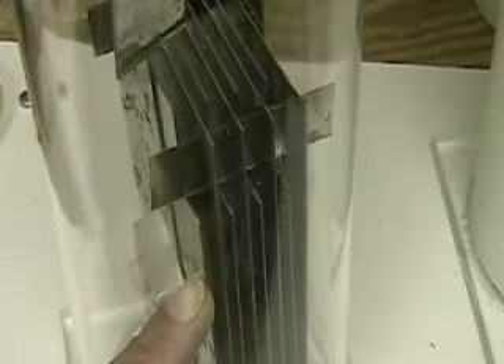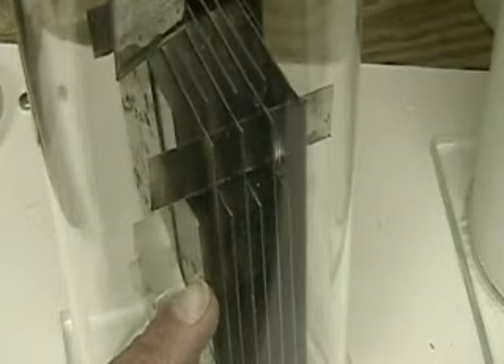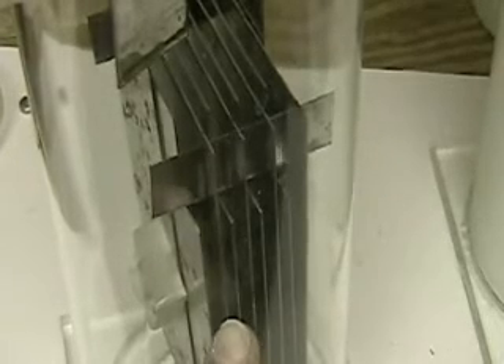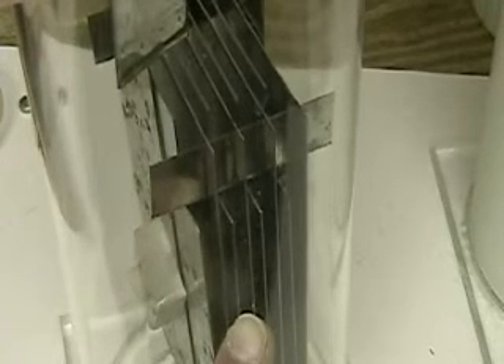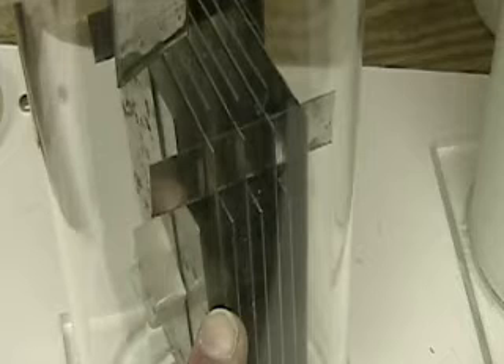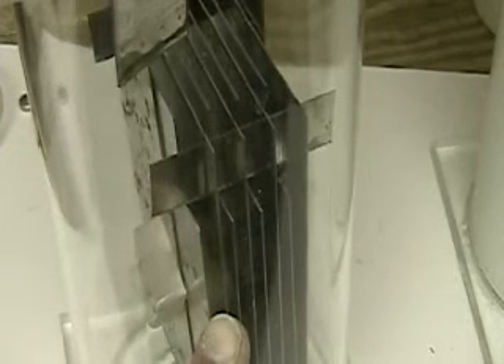It works. This has eight plates in it. There's a magic number — the amount of area that you have to work with. With eight plates at this area, the number seems to be around four or five. Anything over four or five plates at three by six inches requires you to move the plates further apart. What I do is multiply the space factor — there's two-eighths of an inch between each plate now, by putting two spacers in there.